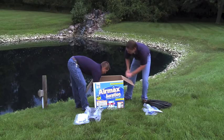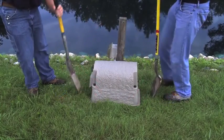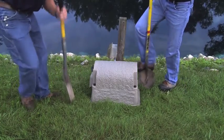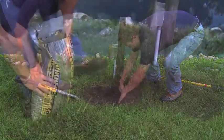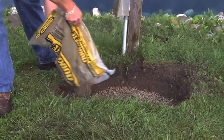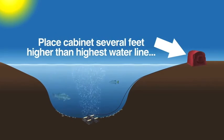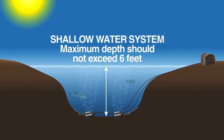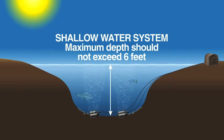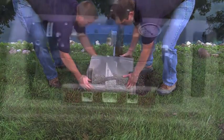It is always recommended that you wear a life jacket and never attempt to perform this installation alone. To place your cabinet, prepare the area by placing the cabinet on the ground where you've chosen to install it. Trace an area about six inches wider than the cabinet on all four sides with a shovel or marking paint. Remove the sod or loose dirt, then fill in with fine stone or gravel — this provides a solid base and allows for proper drainage. Remember to always place your cabinet several feet higher than the highest water line of your pond to avoid flooding in spring or during heavy rains. This is also important when placing shallow water diffusers, as the depth should never exceed what is recommended for the shallow water system. Heavy rains may cause water to exceed the recommended depth, damaging or causing accelerated wear to the compressor.